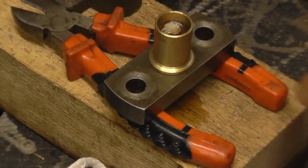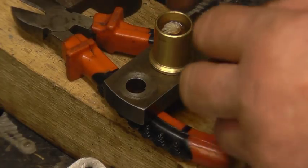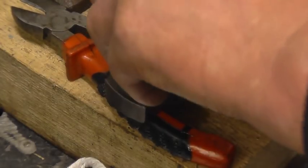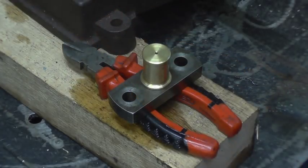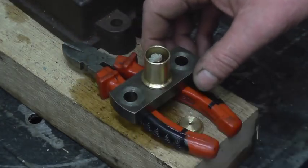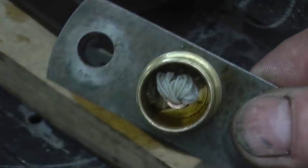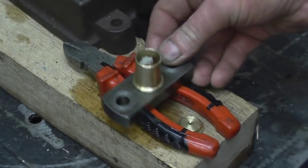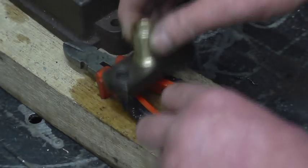You can actually use a little hooky piece of wire instead of the wick and it will work — it'll keep a capillary reaction down the side of the wire. But I like to use wick like that. It's been an hour and a half since I filled the little oiler up, and as you can see it's completely empty now. So all the oil has been pulled up by capillary action, down through the wick and out the bottom.